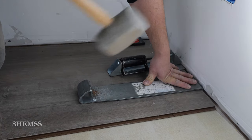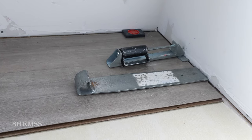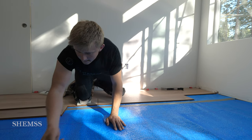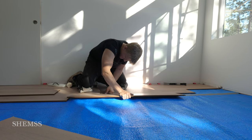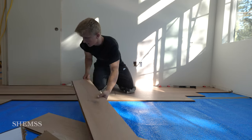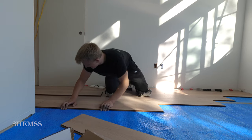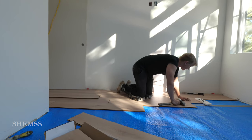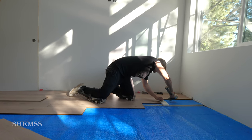There are different ways that you can use your pull bar, so be creative as long as you get the job done. We're going to watch our installer take a go at it fitting one board at a time. This is a great way to learn and assess whether this is something you can do yourself or maybe you want to hire a professional. Pay attention to how he is fitting the tongue into the groove and then using that tapping block like we discussed earlier.